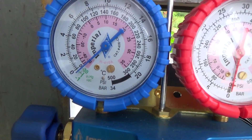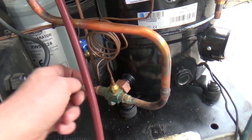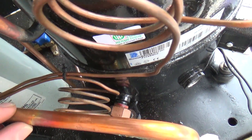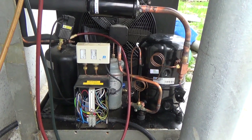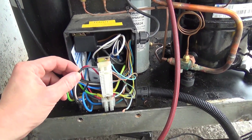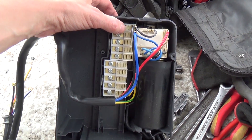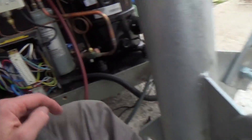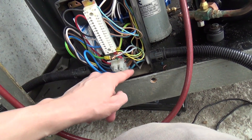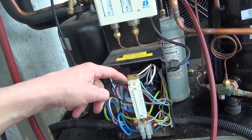Got the vacuum pump on it now. There's a sort of gap between all the coils so they're not going to rub on anything. I'm going to try and join the wiring — it's come to the electrics, to the Copeland ones. For these it's quite simple: that's your live in, your neutral in, 240 volts in — that should feed to the compressor. So pretty much these terminals down here. We can probably use these existing wires to get us up to where we're going to put the new relay and the other capacitor that just fit in the box.